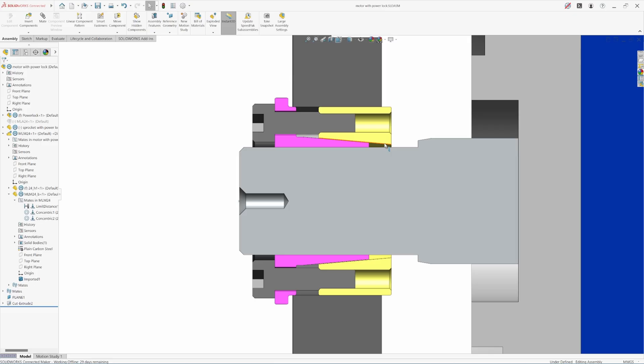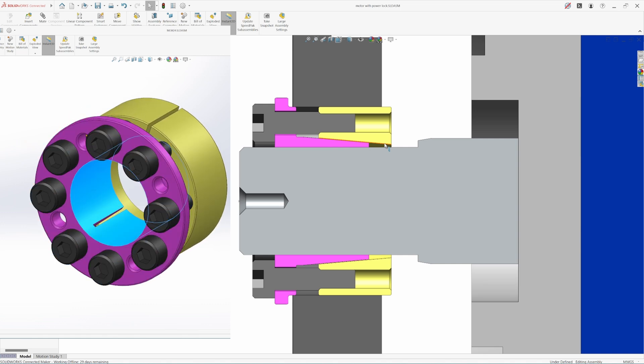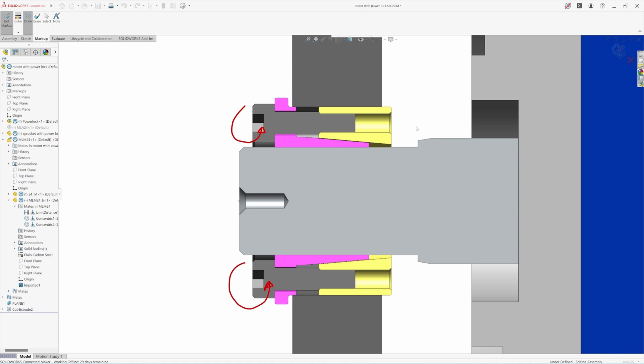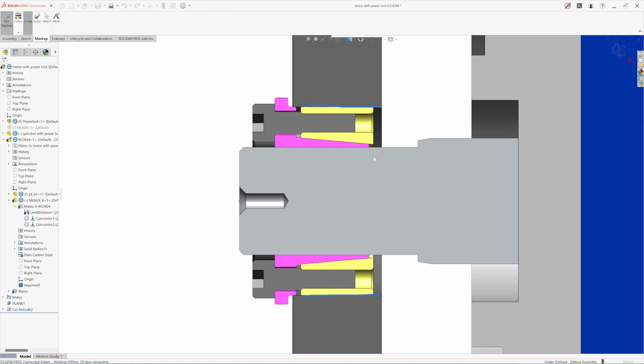In the single taper type there are only two taper rings: one for clamping the hub and one for clamping the shaft. By tightening the locking nut, the hub ring moves while sliding on the shaft inner ring taper surface and inner surface of the hub. At this time the radial force presses the shaft and the inner surface of the hub against each other. This pressure is generated by the wedge effect, and this radial force generates a frictional force that strongly locks the shaft and the hub.